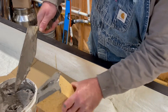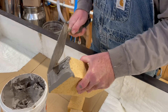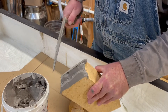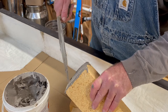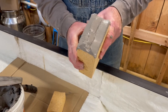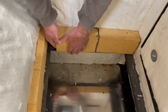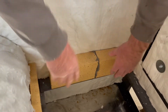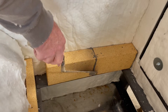What I'm doing here is just trying to give you an idea of what it might look like to smear up some of these bricks. You only need about an eighth-inch mud joint on these - you can go together pretty close. You don't put any mud on the back side, only put the mud on where it goes against the other brick, and you want that joint to be full. Then you can just take your trowel and smear off - you just want it to be full.